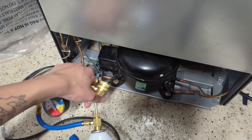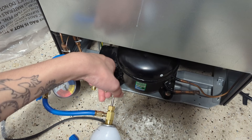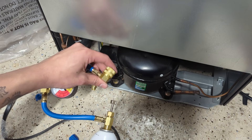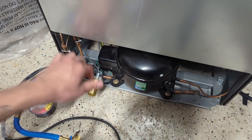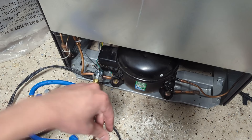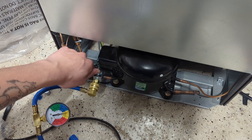Now slightly open this valve until you hear a hiss. You do this by tightening it down — you're going to hear a slight hiss once this opens the valve that's built into the refrigerant bottle. That will purge any air out of the refrigerant hose. Now push this on, and if you have a quick connect make sure it's secure. Then turn this off — turn it counterclockwise, which is counterintuitive because you usually turn things clockwise to shut them off. You can see the pressure is pretty high because there's some pressure in the hose — just open the valve here and pressure will drop to about zero because this one is running a little low.